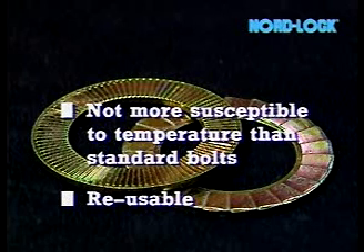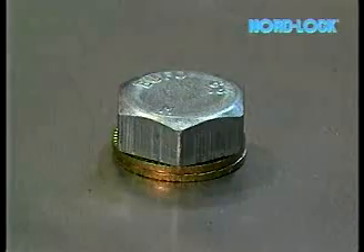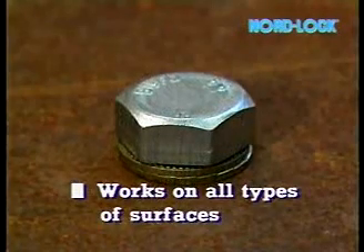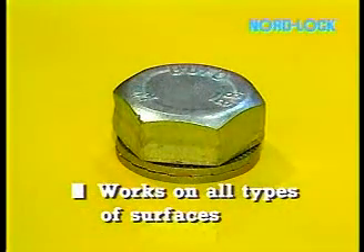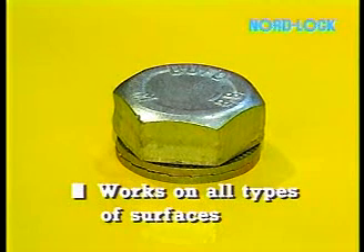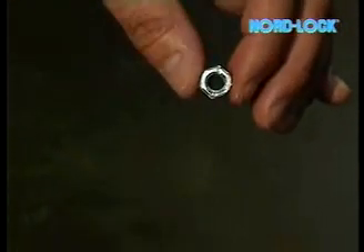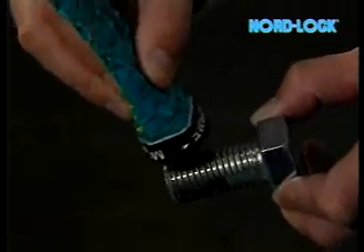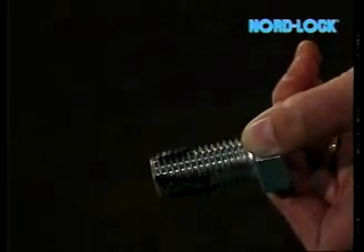This is higher than the hardness of high-grade bolts. The surface of the material is of no importance — it can be rough or ground, but it must not be harder than 45 Rockwell C. Tightening towards a painted surface gives 100% security. Remember that the friction is always lower between the washers than the teeth sides during loosening. When reusing, it is always important to lubricate the bolt to achieve a high bolt force — this is more important for larger bolt sizes. Lubricated fasteners always make tightening and unfastening easier. Nordlock: the simple and safe method to secure bolts.